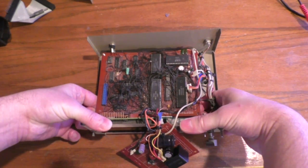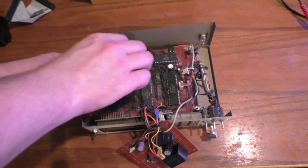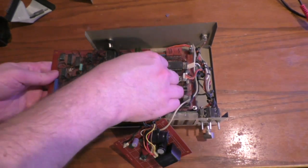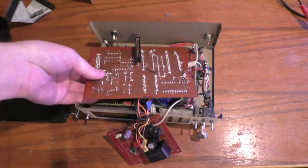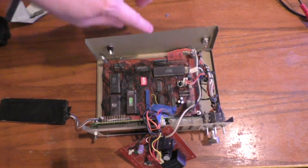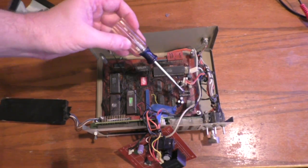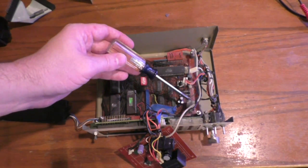There's logic that decodes the SID's address space — basically the only thing in memory is the SID chip and 64K of SRAM, with no 6526 port chips, so you can't do interrupt timers or any of that. The 8255 is run by the 8085, and it will tri-state the 6510's address and data bus, giving full control over the SRAM so it can poke data from the 8085 into the 6510's address space.